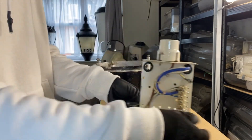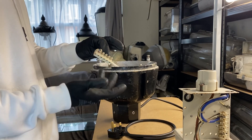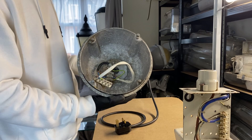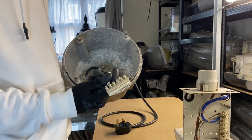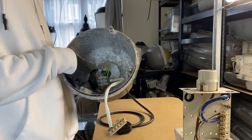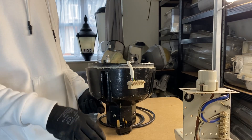Another reason I suspect this wasn't run very much is because this connector isn't brittle. Usually with lanterns the connectors go a bit crispy after a while because they've been exposed to heat from their lamps and gear. That's what's in your base — just a simple mains in and then you've got your two-part connector to connect to the rest of the lantern and the gear tray. I tell a lie when I said none of the screws were seized — that one is there, but that's it, and I think with some good persuasion it would come out.